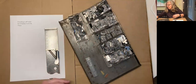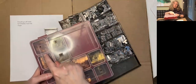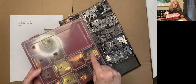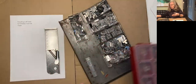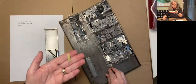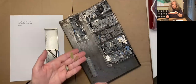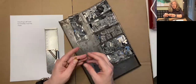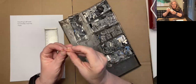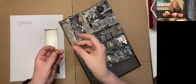And then you also need the brasses and coppers. I have a set here and they are in this box that's labeled either the 8, the 10, the 12, the 18. Brasses and coppers are the thinnest kind of spacing material. You can see one of each of those here. The brass is 1 point, and the copper is half of that. I can't show you on the camera this way, it's blurry. They look about the same, but they're not. It's almost like paper thin.